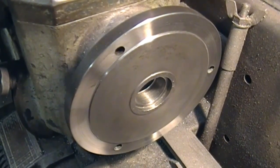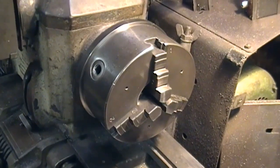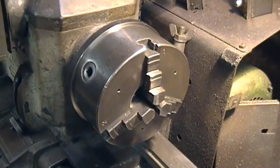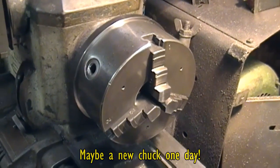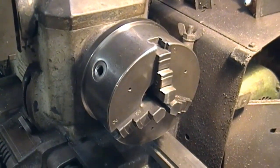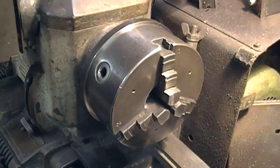There it is back on — not a major improvement, because the main problem is these damn jaws. The inconsistency of the tightening just depends on how I put a piece in and how many times I try it. So it's probably about as good as we'll get on that chuck. If you remember the good reading I had after the rebuild, I think I just hit lucky on that — it was the best I could get, but it doesn't do that every time.